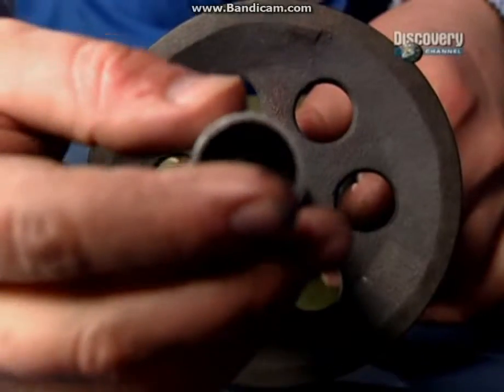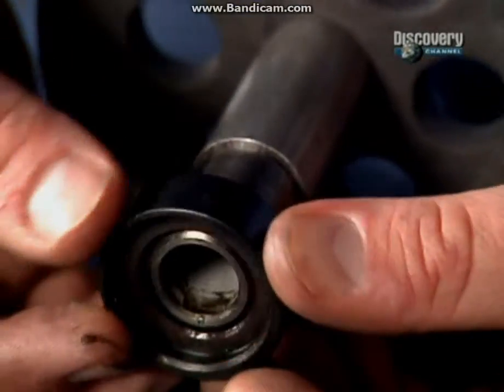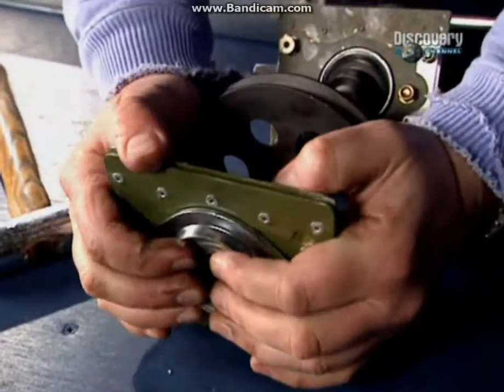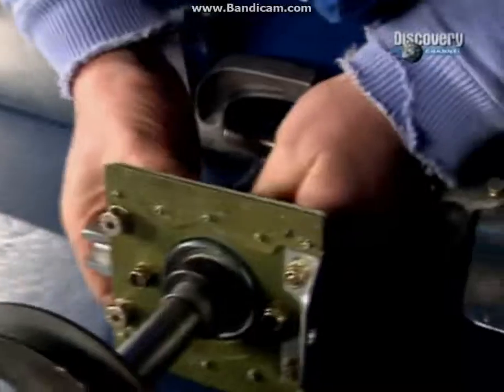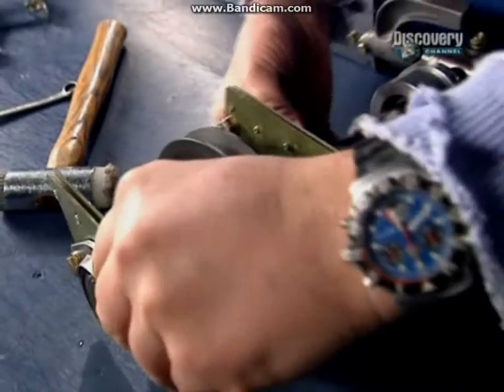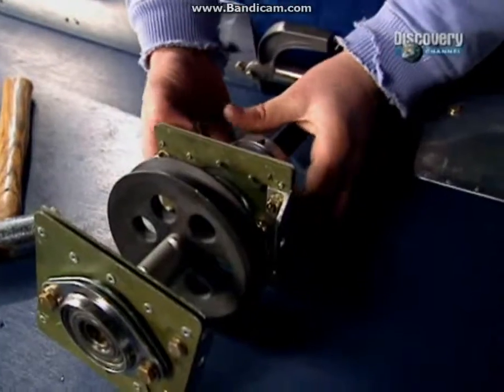And next goes on this sleeve, then the bearing lock there, and then finally the other bearing plate. There we go. So all the other bits this side, on the blade side, can all slide up towards the boss of the pulley, like so, and then the whole lot can go in the tail boom.